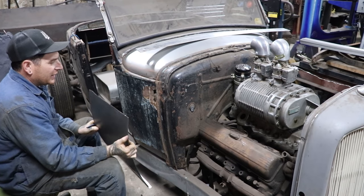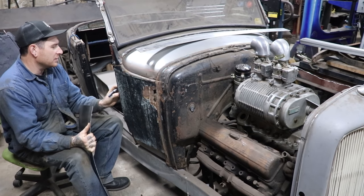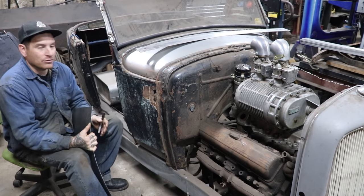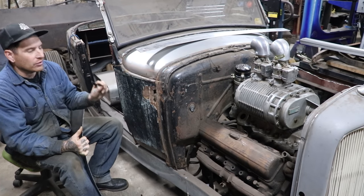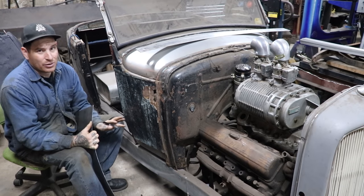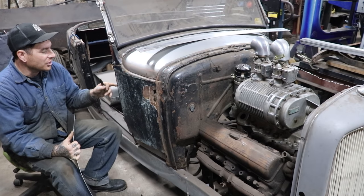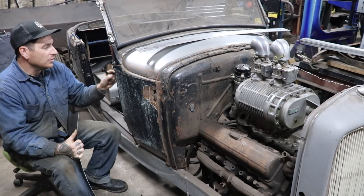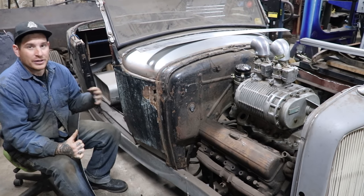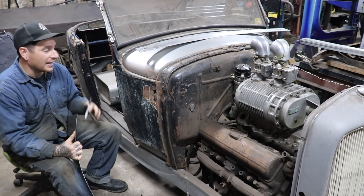Now what I'm working on is getting the edge broken inside of the door jamb here. The way I welded it is I left some of the original door jamb and basically welded it right in the corner. That's a little easier to finish out and make the repair hidden. If I welded it on the outside of the panel, you're going to get a lot more distortion because the heat is going to go out there and cause warping in the center of the panel. Anytime I can stay away from the center of a panel — some guys are able to do it — but for me it's safer to have a broken edge and weld it in this corner because it's really strong. I can cut it right in that corner, weld it down in there, finish it with a mini sander, and you'll never see it.